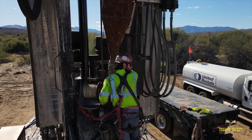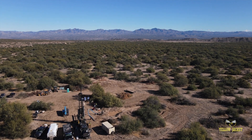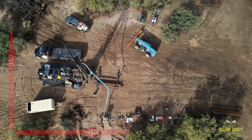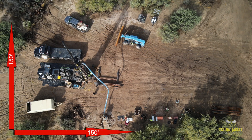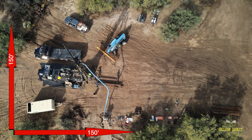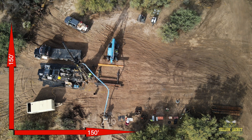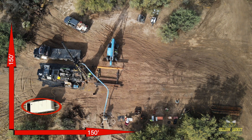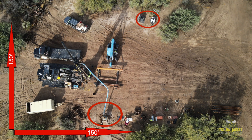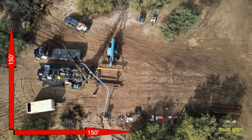Whether drilling for deep geological and hydrological samples or installing wells where environmental stewardship is of the utmost importance, our clients can rely on Yellow Jacket Drilling. Yellow Jacket's carrier-mounted DR 24HD and its crew require an approximate footprint of 150 by 150 feet and can accommodate more restrictive sites as necessary. The site setup includes the rig and pipe trailer, compressor, containment vessels, and light plants for 24-hour operation, as well as auxiliary equipment including a forklift, water truck, and a doghouse when needed.